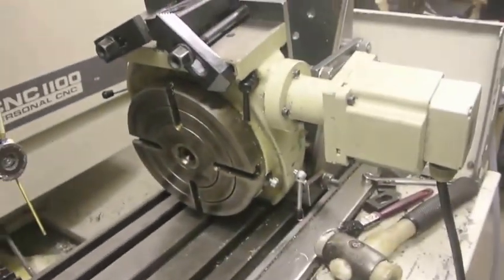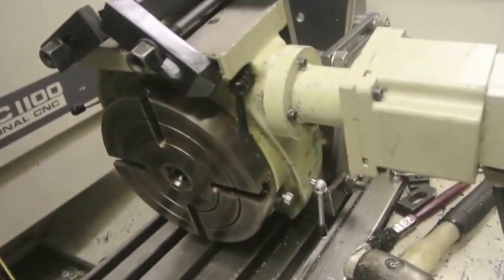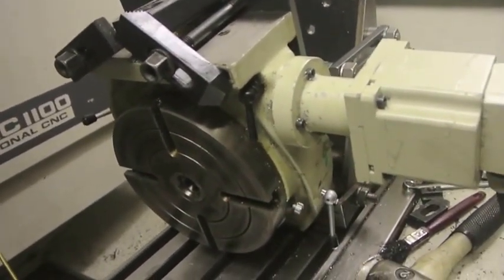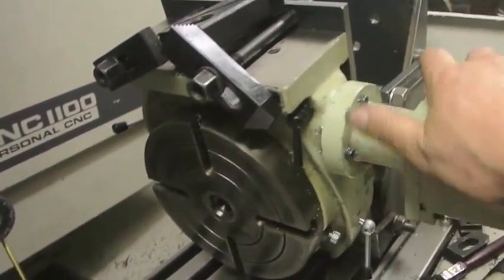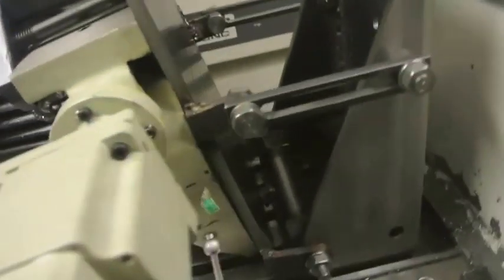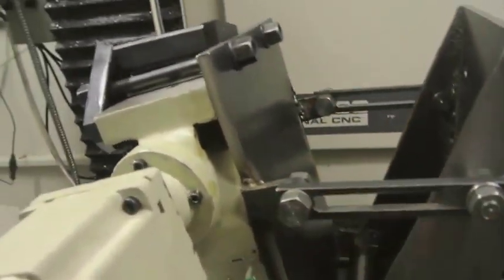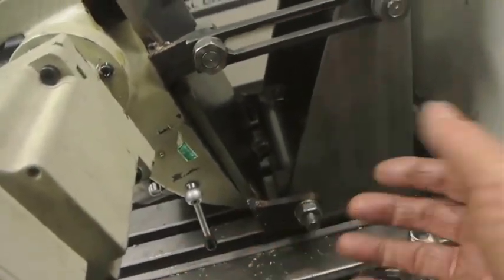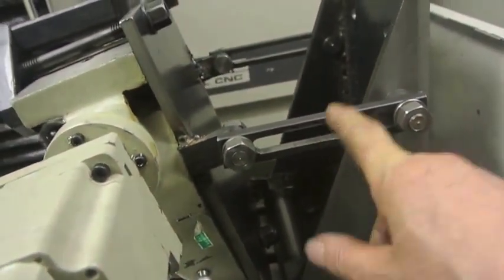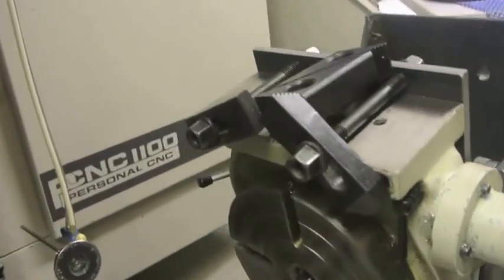Well, I've finally finished making my adapter - my adjustable angle plate - so that I can mount the 8-inch rotary table, which I bought when I first got the mill, in this position and also alter the tilt on the table. It's pretty basic, but it can be mounted vertically and it can be mounted in the horizontal position. The length of these links is not very long, however if I made some longer ones I could increase the angle they tilt by quite an amount.